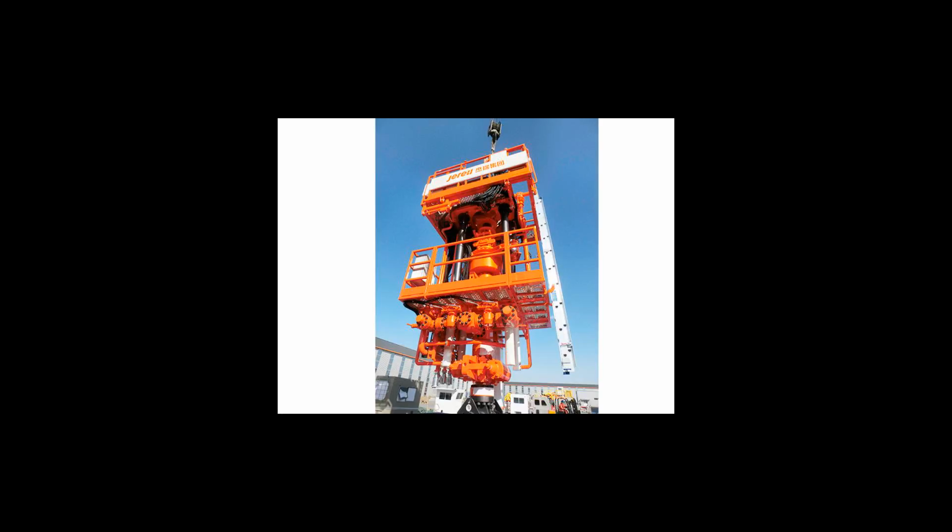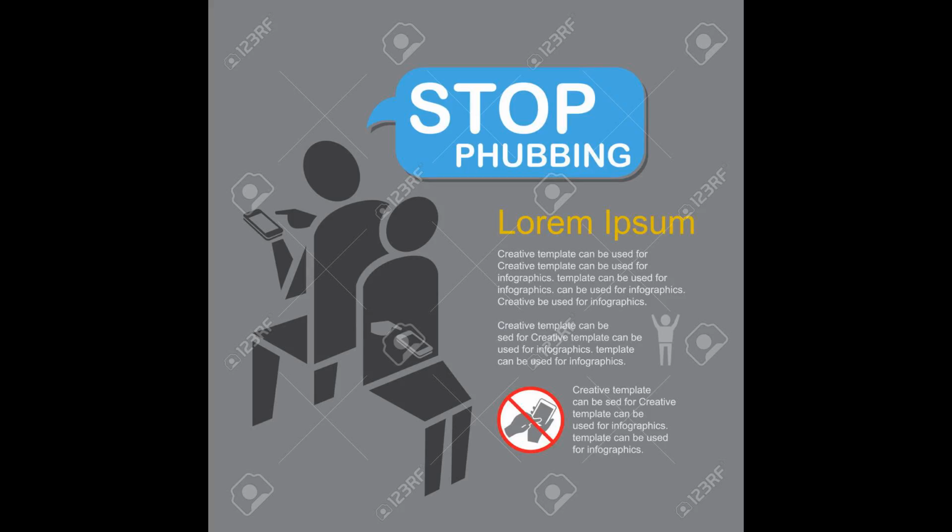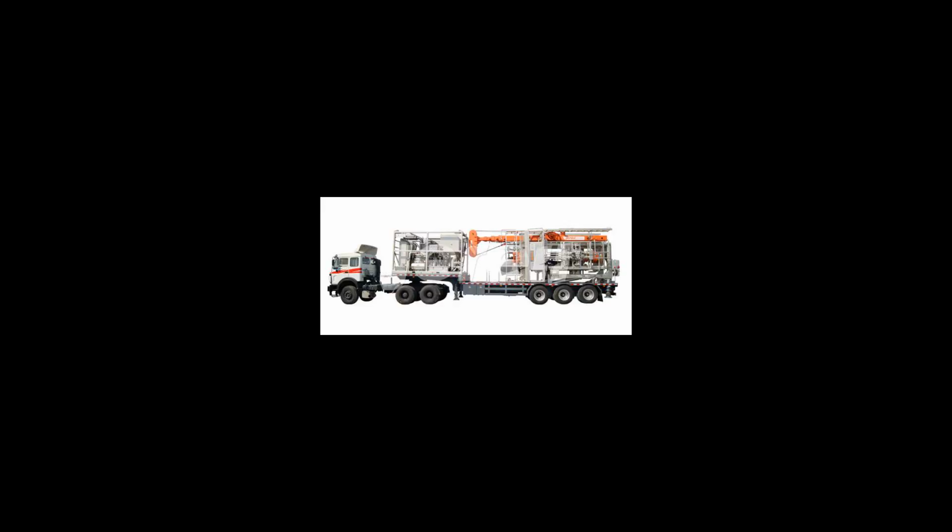Unlike coiled tubing or wireline, where the wire tubing is always the same diameter allowing for a single unmoving primary barrier, stuffing box or stripper, snubbing uses a pipe, which will have an enlarged collar at the connection between the joints. Therefore, the pressure control system must be able to accommodate this variable diameter. The stripping rams accomplish this.